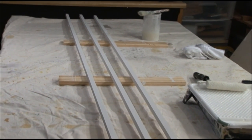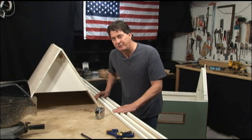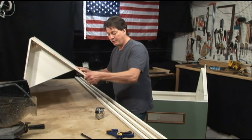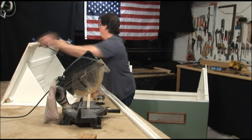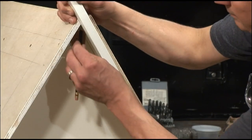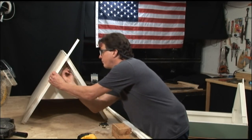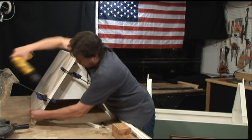We decided to cut ¾-inch by ¾-inch pine to pack out the soffit and the gable ends. These pieces have already been primed and painted with three coats. We're going to wrap the inside perimeter of the roof — this wood gives something to nail to for our drip edge, and also serves as a handle when lifting the roof off. Start with the clean edge, get your measurement, transfer it, cut your piece, put it up with quick grips and screw it in. For the gable, butt it up to the newly installed soffit piece, scribe your line, cut the angle, clamp and screw it in. Do the exact same thing on the other side — line it up, make your mark, cut it, clamp it, screw it.